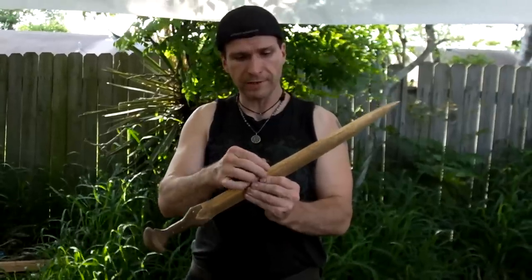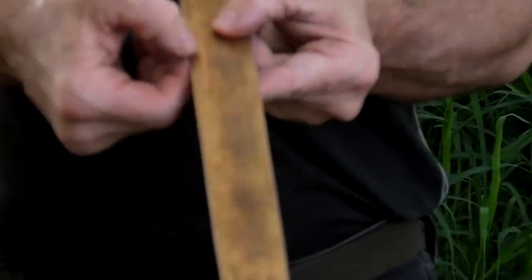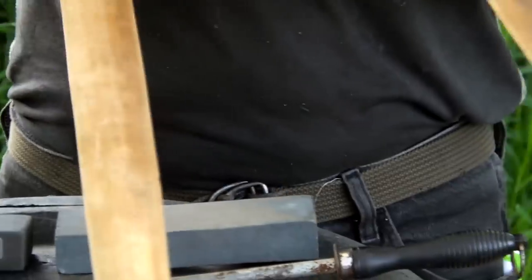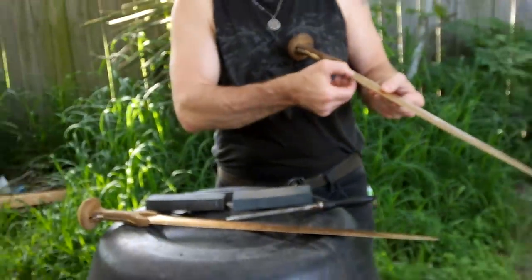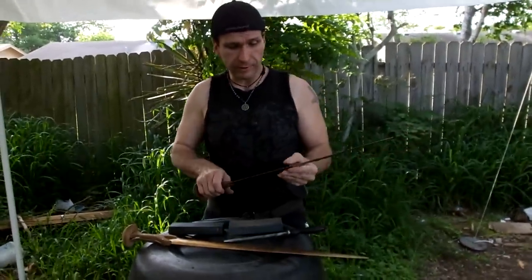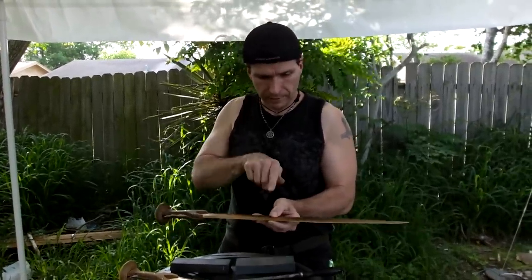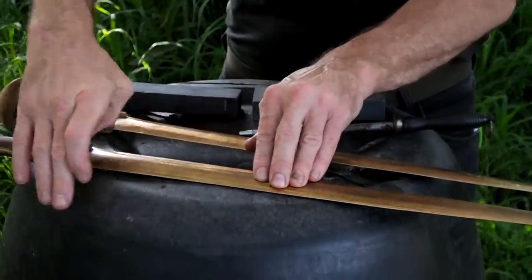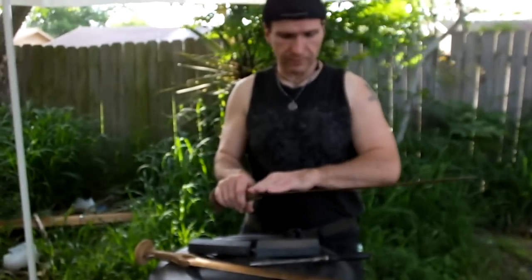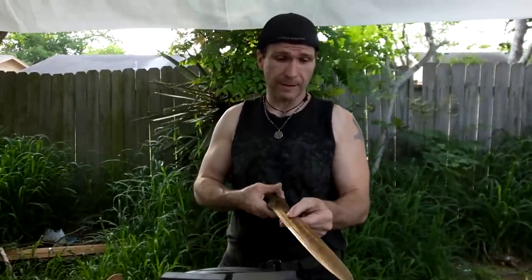Then look at your edge and see if it's actually bent. Even on modern tempered swords, you can get an edge that bends because it's so thin. You need to straighten that back out. If you look at Neil's blades, he's gone to a lot of work — you pay extra for the hardening along the edge. Most people don't actually hammer their bronze swords, but you can see the hammer marks on these blades, which helps harden the bronze. He's also hardened the edge by putting a groove all the way down it to reinforce it. You don't want to take any metal off unnecessarily. If you have a badly bent edge, you might even need to use an anvil, a flat chisel, and a hammer to tap it straight. Grinding with sandpaper would probably be a big mistake because you'd lose so much blade material — I would not use sandpaper unless absolutely necessary.